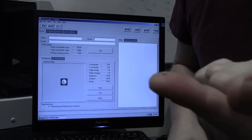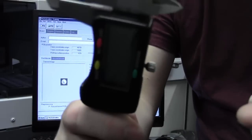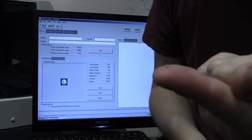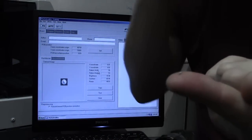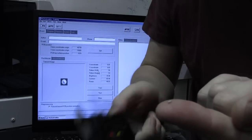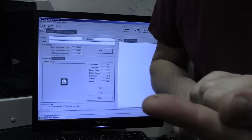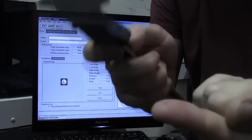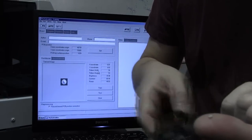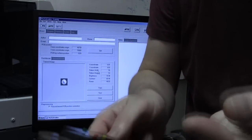Other things that you need to know is the length and width of your component. So take your device, measure it. You can estimate the length and widths. That's not as important as the height. So if you know what your package is, say 0805, that's what these ones are, it'll be 2mm by 1.2mm. If you're not too sure, then measure it. Height, always measure. Can't stress that enough.